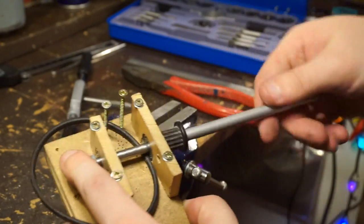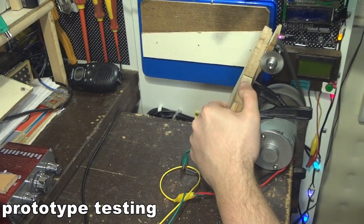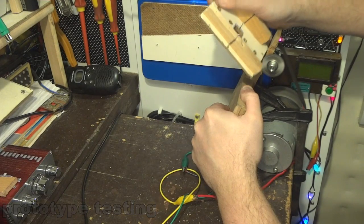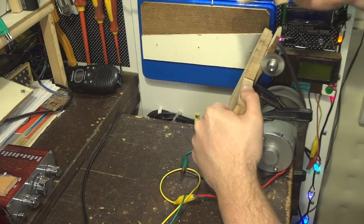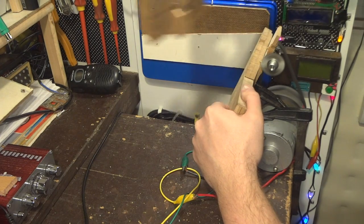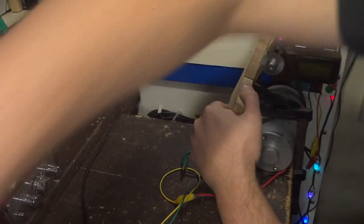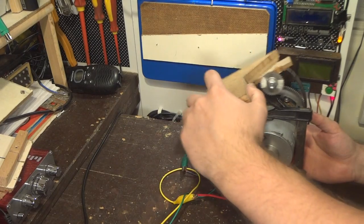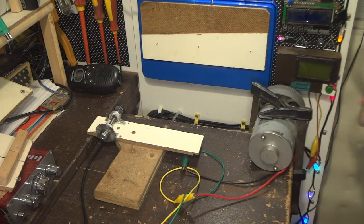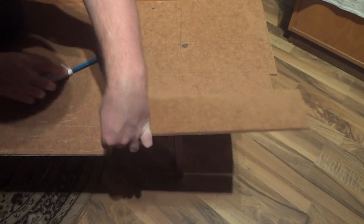When I had the driving system done I could start testing as a prototype. The key for making a good project is a good working prototype. The testing showed me that I will be able to cut through MDF, but only with the smaller saw blade with just bigger teeth. That means I am going to have a very small cutting depth. The cheap saw blade is going to be the weak link of this project. At least the blade does a narrow cut, so only a minimum amount of material is removed and cutting does not create too much dust.